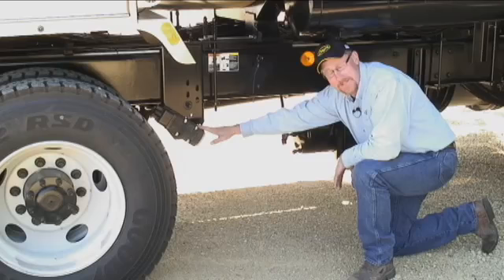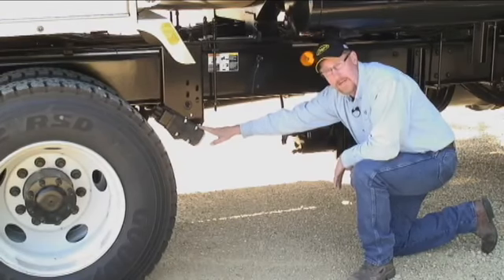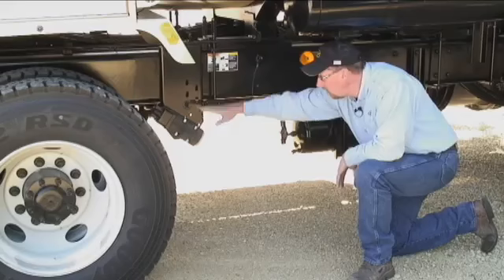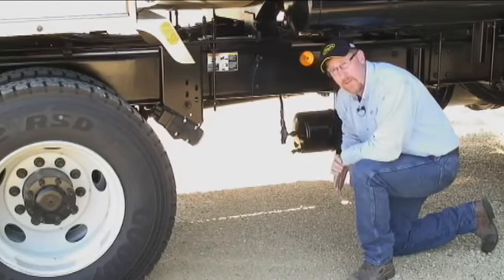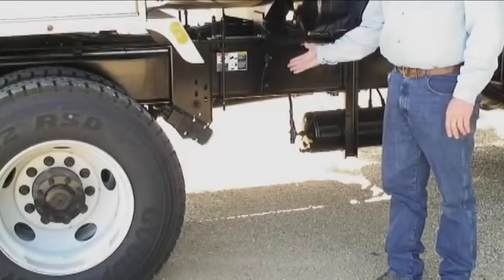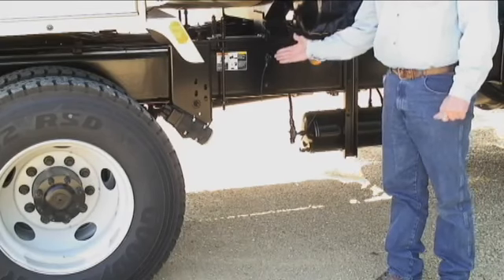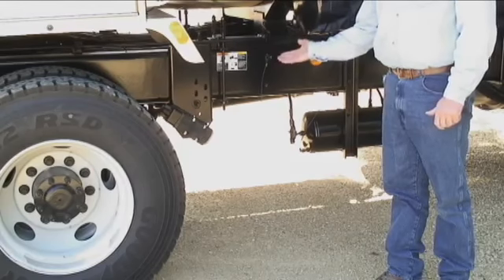The angle of the radar is crucial to the proper rate of application, so you'll need to check your operation manual and operational video or maintenance guide to make sure it's set at the correct angle. It is on an adjustable plate, but it is set correctly from the factory so that your feet per minute will come out correct. The radar may be located in a different position on every chassis, but it does not matter if it's pointed forwards or backwards as long as it's set at the correct angle.